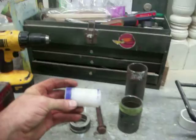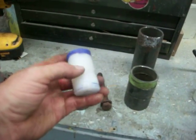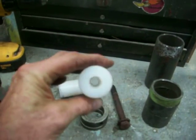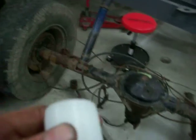I also got some bulk urethane the other day. What I'm going to do is use my lathe to turn my own bushings. I started doing it as you can see — it's not perfect because I'm doing a little trial and error. This stuff cuts pretty quickly so you have to go easy with it. This one looks a little better, but these are just my trial pieces and I need to drill a bigger hole in here. What I like about the lathe is that you can make stuff perfectly centered — the hole through that looks like it came from one end and out the other, rather than being off and not getting the bolt through. Even with these being temporary, you can see that will be a nice fit.